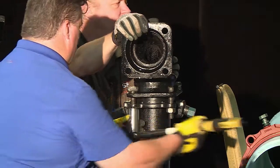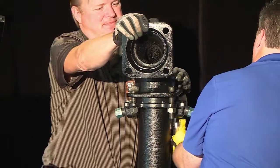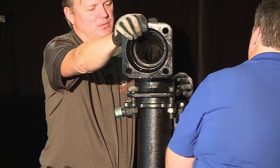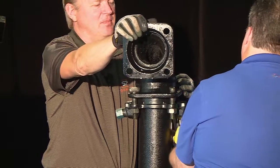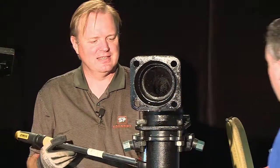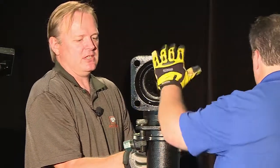The big thing with a torque wrench, you should always bring it back to the lowest setting when you're not using it, otherwise the springs can get out of whack. You don't really need to zero it in between, but it's not a bad practice. But when it is in storage, you are supposed to bring them down to your lowest torque setting. And as the one audience member we have said, keep it out of the mud, keep it clean. This is the most precision tool you will have on the job site. So keep it clean, keep it good.